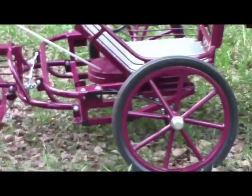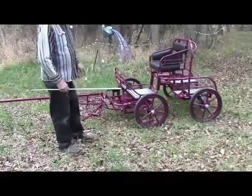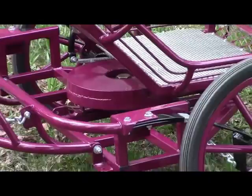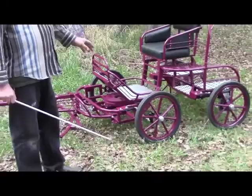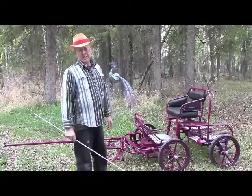This cart has a full fifth wheel in it. It's a 12-inch diameter fifth wheel made out of plate steel with a quarter-inch thick UHMW plastic disc in between the two steel halves. It's connected by a one-inch diameter grade eight steel bolt with heavy washers top and bottom and a lock nut on the bottom. I've used this style of fifth wheel because of its simplicity and longevity — I've pulled large semi trailers over 2 million miles using an exact similar style fifth wheel.